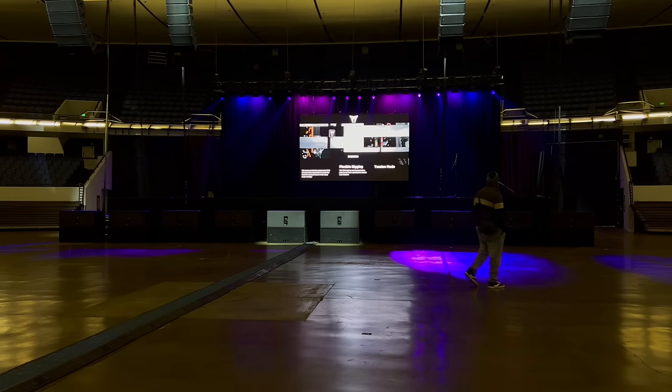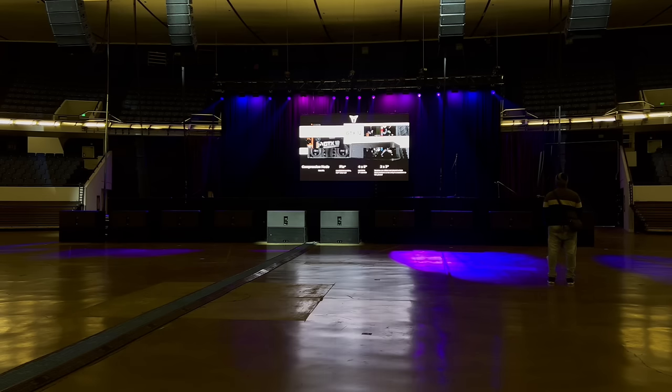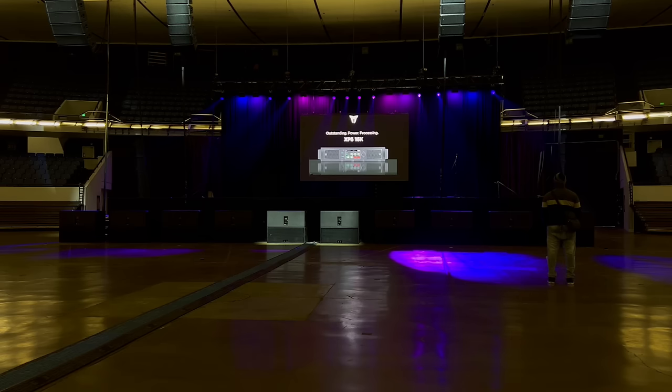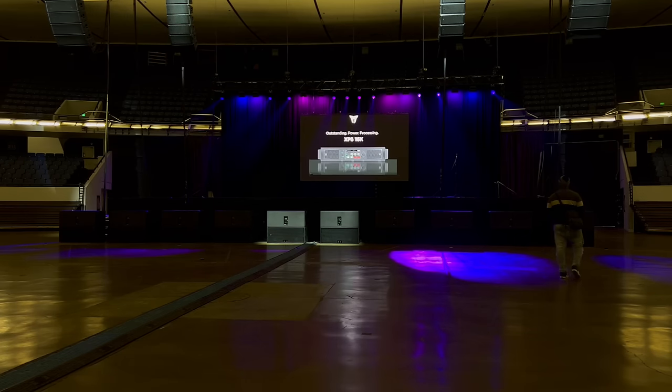Up to 24 GTX 12 modules can be mounted on a single flybar. The TT Plus Audio GTX 12 offers excellent playback quality and high SPL. Powered by our new XPS 16K 4x4000 watts RMS amplifier with four analog and digital AES inputs and buffered digital outputs, optional Dante network connectivity and full signal processing, tuning, impedance monitoring, and routing capabilities, all at 96 kilohertz.